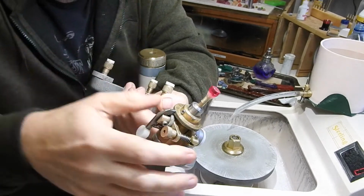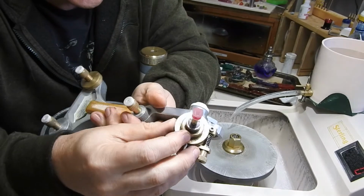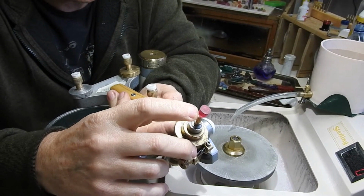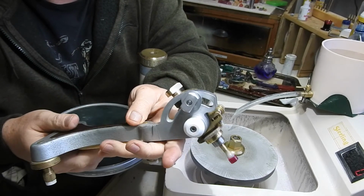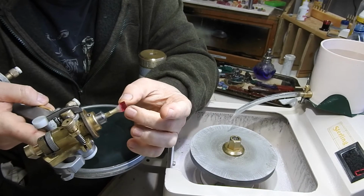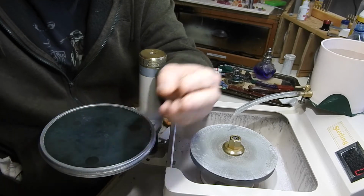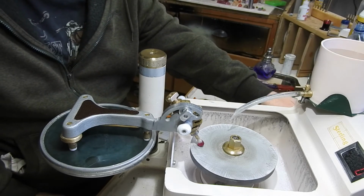Here we are with this transferred corundum, ruby ball, lovely colour. We've faceted the pavilion, so we're now going to lose most of this and do the crown. And the first one is at 31.15, that's on the protractor. And assuming I've lined this up correctly, it's at 2 degrees. So let's start.